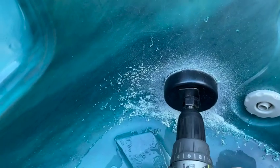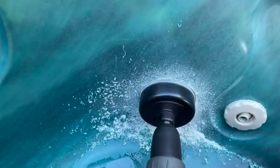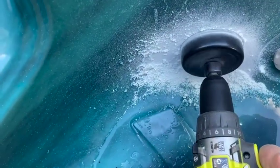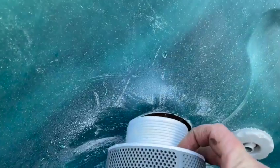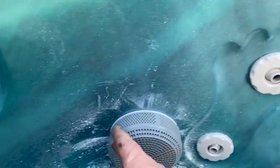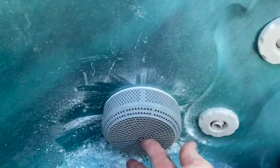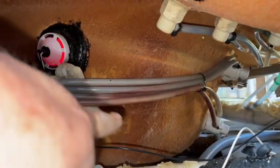When you're drilling a big circular hole like this you can just move the drill around so it's cutting and pressurizing in different spots. You can see how far we are so far — the center hole holds it in place — and we're through. We've got a hole and it's the right size for the fitting. These are foot spots where you have four jets for the feet; it would have been nice to get away from that a little bit but the curve is right here so I had to keep the suction away from the curve otherwise it wouldn't sit flush and seal up nicely. Now I'll drill the other one — I've got foam behind the pipes for protection and I've also lifted them up so the drill won't nick any of those lines.